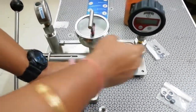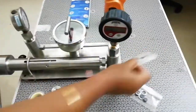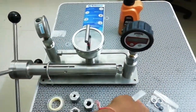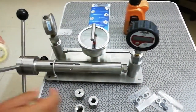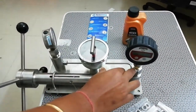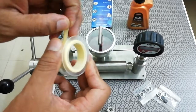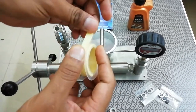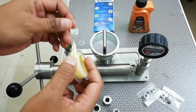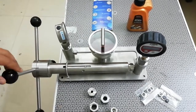The thread size of gauges will differ, so adapters are necessary. You can also see the washers and O-rings provided. Ensure that when you are fitting the gauge onto the thread, you use Teflon tape. This Teflon tape seals the gauge and will not allow oil to come out — otherwise you will face leakages.